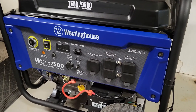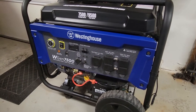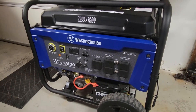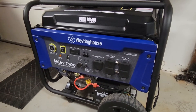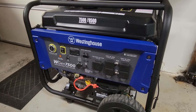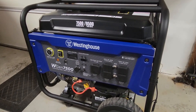Once you have it filled with fresh fuel, you want to run the engine. I would recommend doing this every couple of months, every eight weeks or so. You don't want this generator just sitting for months and months, or maybe a year or more, and then suddenly when you need it, it won't start. By running it every couple of months — I usually run it for about 10 minutes — you're verifying that the battery's good, the fuel's good, the engine starts, nothing's going to get gummed up or seized up. It also gets your oil moving, and you just know that when you need that generator, it's going to be ready to go.